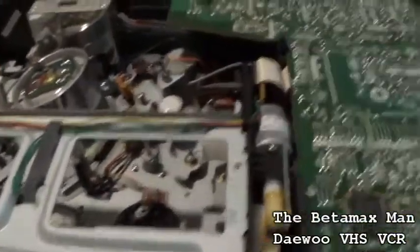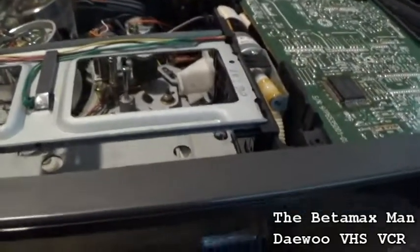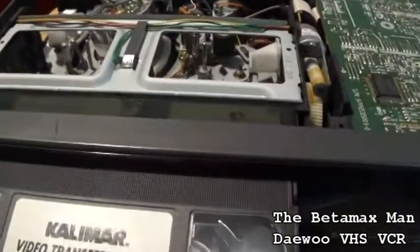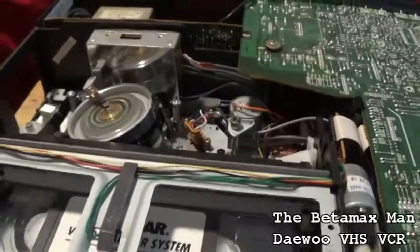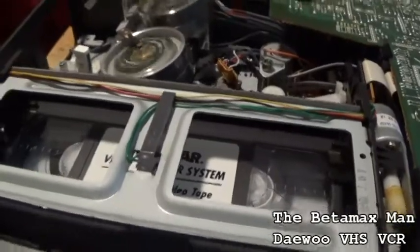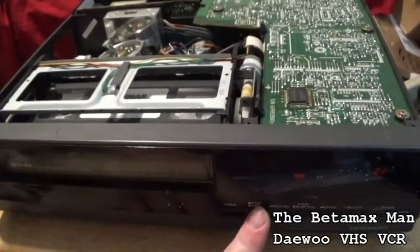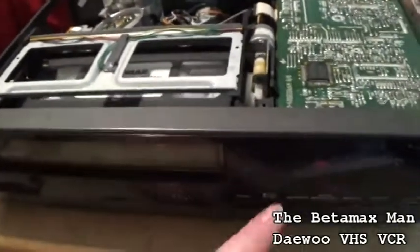Anyway, I'm going to turn the volume all the way down so we don't hear that static. This does not have an on-screen display like the newer VHS systems. Let's just see what's going on here and why we have a mess when we're trying to play. Well, it looks like our idler tire has failed, huh? Let's try forward. Okay, so we've got an idler issue.